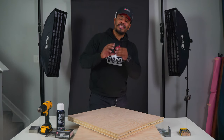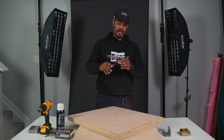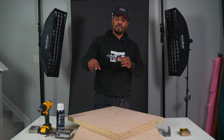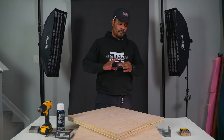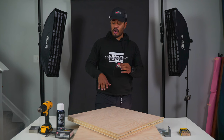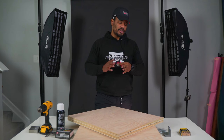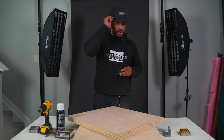Also have a tape measure. The tape measure is going to be important because this wood is about 3/4 inch thick, and so I want that screw to sit right in the middle of that. So what I'm going to do before anything is mark off where I want these screws to go. And I'm probably going to put 3 in each side where I bring these pieces of wood together. So tape measure, and you see I have my marker right here.